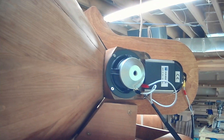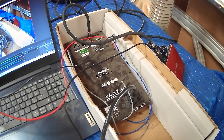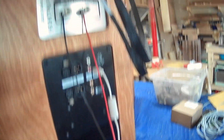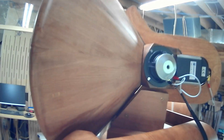The idea here is that the horn with the mid-range and treble — it's a co-entrant horn — is 98 dB. The idea is to run a low-power tube amp. For today we have the FA501, which is a class D 500-watt plate amp that's particularly devoid of any sonic characteristics — it's a very clean-sounding amplifier. However, if you want to use your favorite low-power tube amp, you're able to capture the sonic character of the tube amp for both the bass, mid-range, and treble, regardless of whether active or passive. For those that love the particular sound character of their tube amp, this speaker configuration allows you to fully capture that.